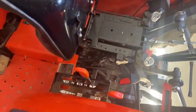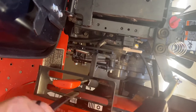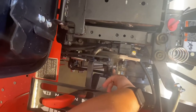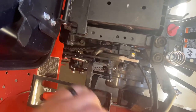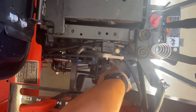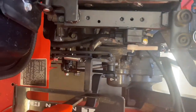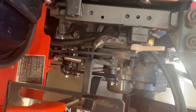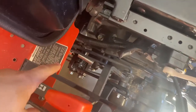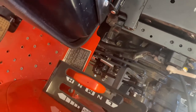Here we are on the left side of the tractor. Here's the new cruise control lever right here. There are a few things that need to be changed to allow you to get this lever in here. First thing is the bolt here that the range select and the new cruise control lever actually pivots on. The kit comes with a bolt — you pull out the old one and replace it with a new one. Additionally, there's this bracket right down here. There's already an existing stud on the tractor; you attach that bracket there using the existing bolt. All that does is hold a return spring.